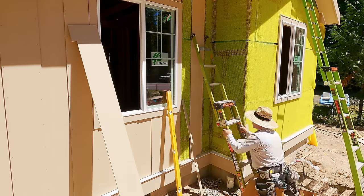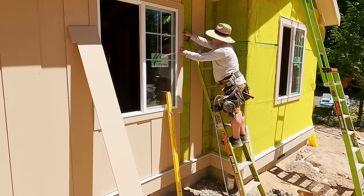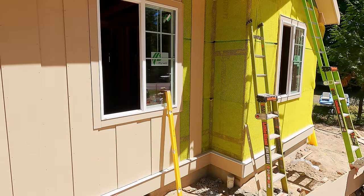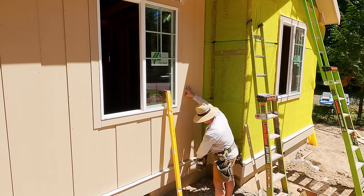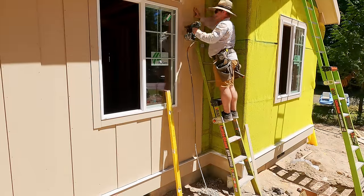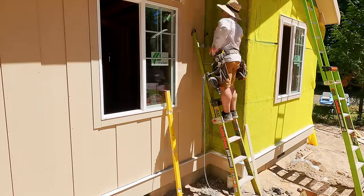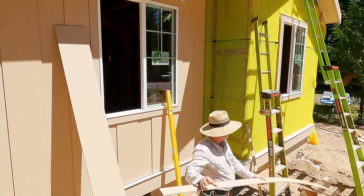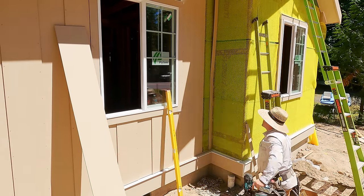On my first piece to the right of the window I go ahead and plumb it — I know my gap and layout are correct at the bottom so I just plumb it so I don't have to get on a ladder and measure the top. The first piece I cut around the window — I make sure it's just right, sometimes I have to cheat the reveal above and below the window. That's the piece that really matters. The board goes on first, then the second board goes on top, and it's that second layer where you have to be a little more careful, like any other siding.